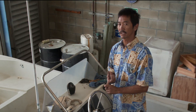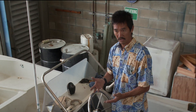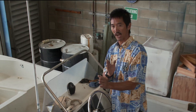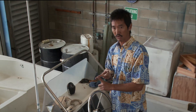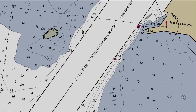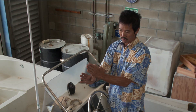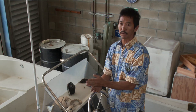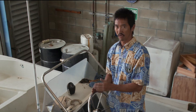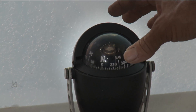The other way you can check a compass, besides with another compass or something you trust that's accurate, or GPS, is that the range markers that align you coming in and out of the channels for some of the different harbors — if you go on the chart, it will tell you exactly what the compass reading to or from the harbor is. So you sit down, you line up the two range markers, and read that on your compass, and you can adjust your compass so it will read properly. Then you turn around and go the other direction, and then you can check it again.